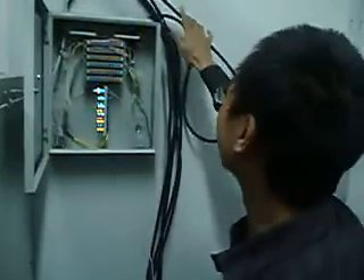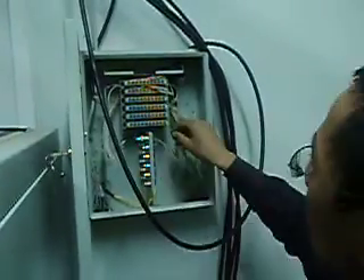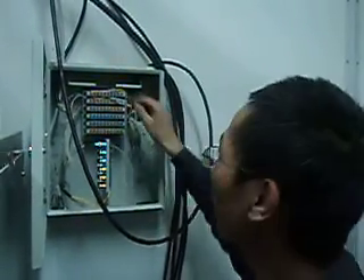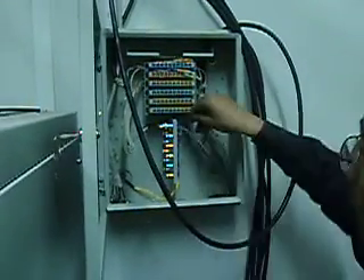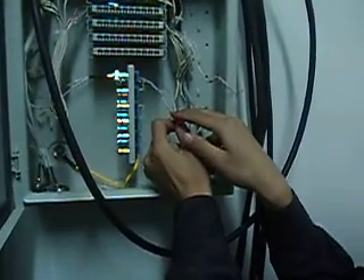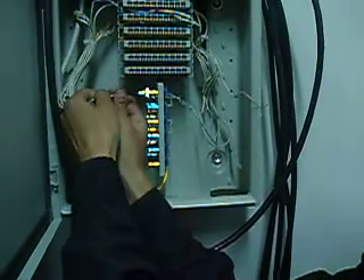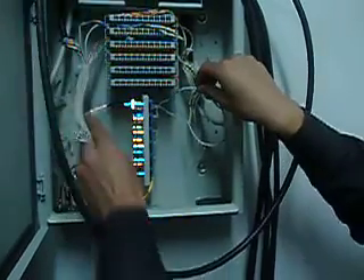This side is not good. We should choose a good side. From BSC, we should connect the first E1 here to BTS. We can see the numbers on the cable — one is in, five is out. BTS also has numbers, one and five. We connect one to five, one to five.